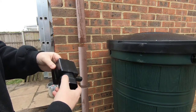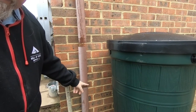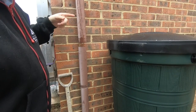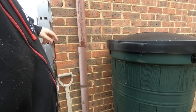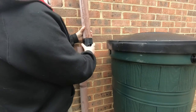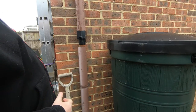There's a little ridge to get the diverter into, and I've undone one of the clips at the bottom of the drain pipe. Ideally I should have undone another one further up, because what happened is the whole thing slid down and the drain pipe isn't connected at the top - but that's okay. This gives me enough room to manoeuvre the diverter into place by pushing it up and bringing it to one side, then carefully bringing it back down.